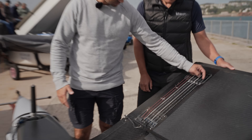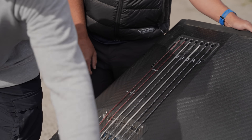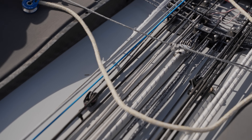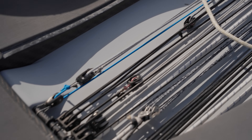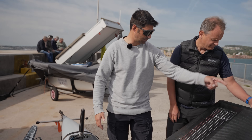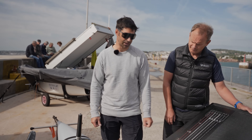The control lines run all the way back down here, and all the take-ups are now underneath the deck. Having the top fairing that is removable just gives really easy access to it. It means that the edge of the wings can be a lot thinner for airway purposes, rather than where we traditionally used to run the take-ups along the wings.